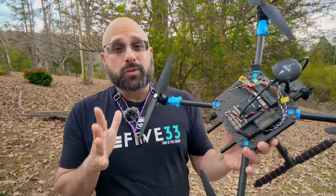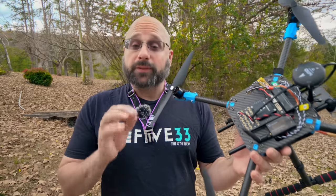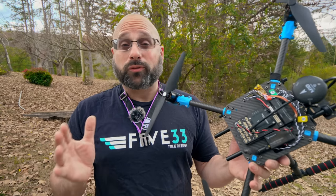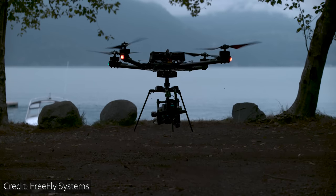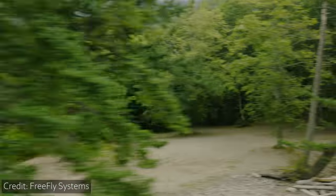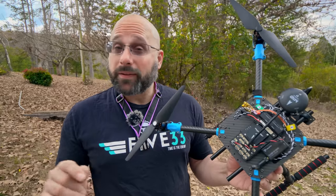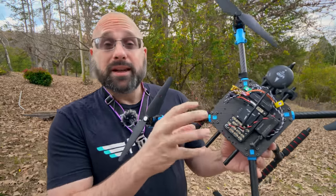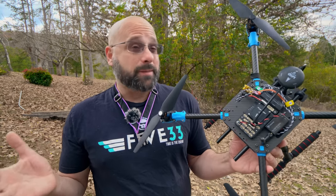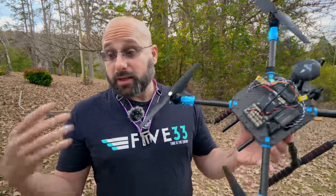Because this kind of quadcopter can do things that FPV drones can't — things like loiter, fly a GPS mission, and fly through the air without having to be manually controlled all the time. There are a lot of commercial and industrial drones out there that need these capabilities. And did I mention reliability? This flight controller has redundant sensors: dual gyros, dual accelerometers, dual compasses — two of just about everything — and the ability to detect if one isn't working and prevent a crash.